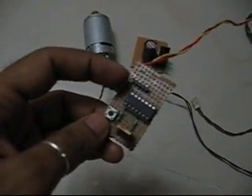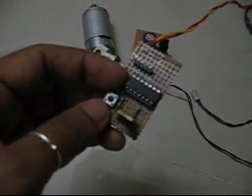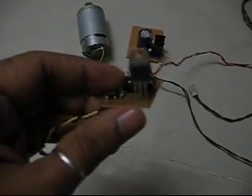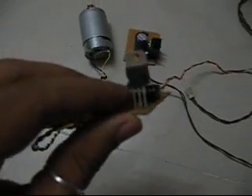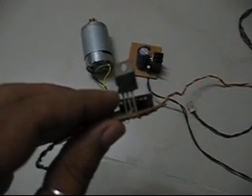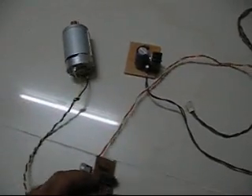This is a 5-pin header for in-circuit programming and this is a PIC16F684, an 8-bit microcontroller. This is the transistor — I wanted an NPN transistor but didn't have one, so I used a PNP TIP127 Darlington transistor. And this is my power supply.